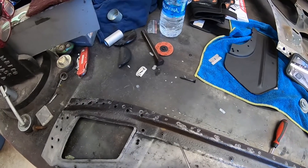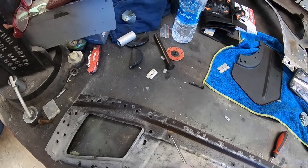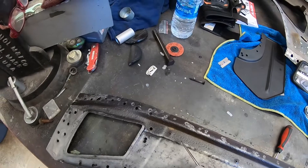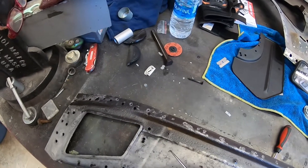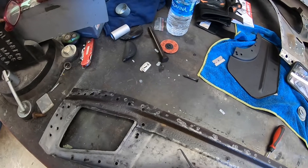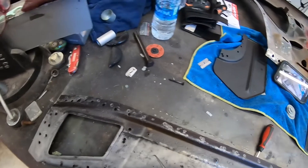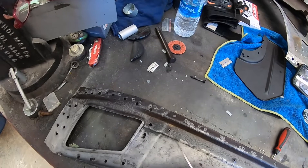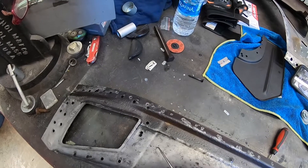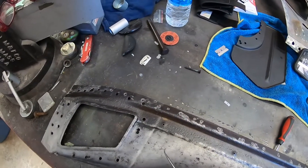What I need to do is go over this again. I need to get down into the pit, so I probably need to go over this with a wire wheel real quick, get some of this off, and then re-apply Ospho before I neutralize it and wash it with warm soapy water to finish it completely. After that you can either leave it like this, sandblast it, or 80-grit it — whatever you want to do to give it tooth. This is supposed to leave a tooth — it's a chemical that etches the metal.